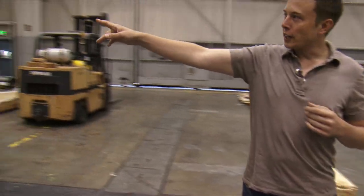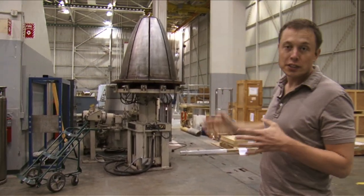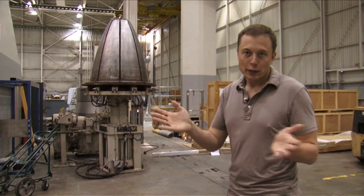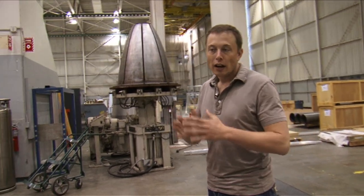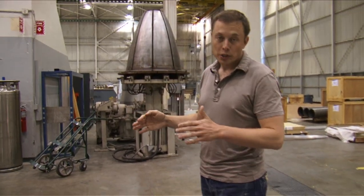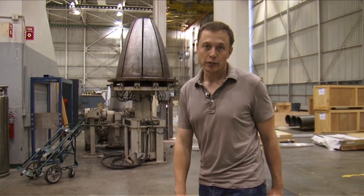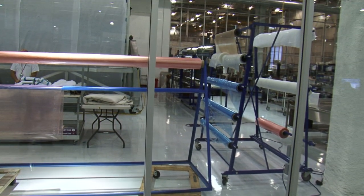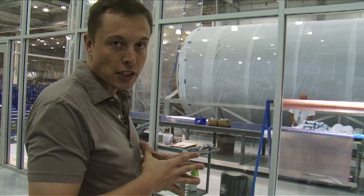That's a Falcon 1 second stage bulge former — a classic bulge-forming tool used to take two welded cones of a refractory alloy metal, like a columbium-hafnium alloy, and bulge it to a round contour, which is the optimized contour for maximizing rocket thrust efficiency. This area is also climate controlled and currently used for propulsion components as well as composite layout.